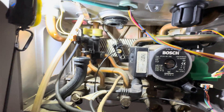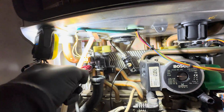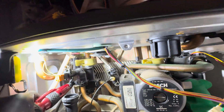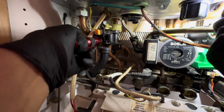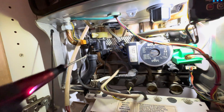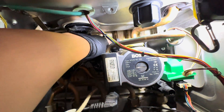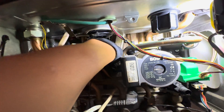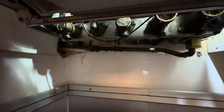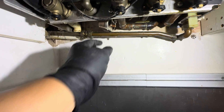There's your plate at the back there. What you want to do is allow that to free up a little by taking out those two screws, then tilt the right-hand side up and the left-hand side down, and hopefully you can pull it out. Often these are quite hard to get out — sometimes you'll have to cut the hot pipe, sometimes you have to take out gas pipes. This one looked a real tricky one because it was piped from behind, but I'd argue this is probably one of the easiest ones I've done. You can see my little technique: tilt it up to the right and shimmy it down underneath, but in this case we have a PRV pipe in the way — and eagle-eyed people will notice that PRV is running slightly uphill.